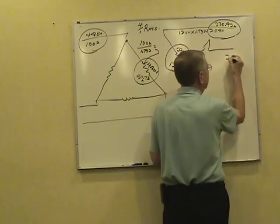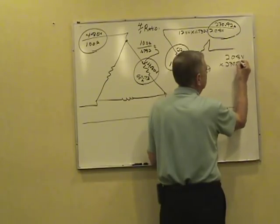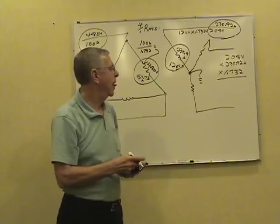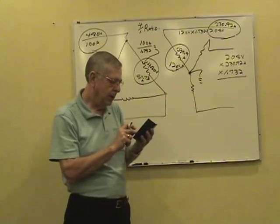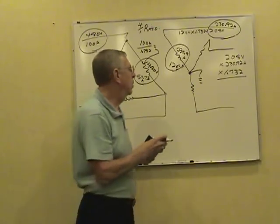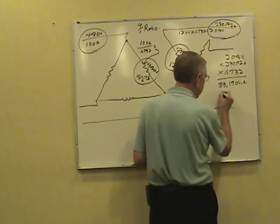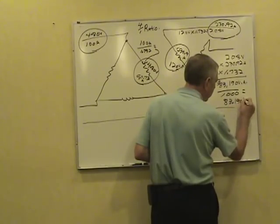To get that total three-phase load, 208 volts line voltage, times 230.92 amps line current in each of the three, times 1.732 for the total three-phase load. Okay, 208 times 230.92 times 1.732 is 83.19. We got 83,190 volt amps. If you need kVA, you divide that by 1,000. 83.19 kVA, total load.